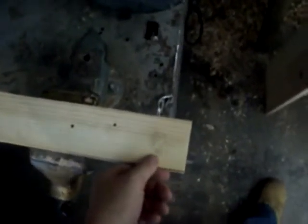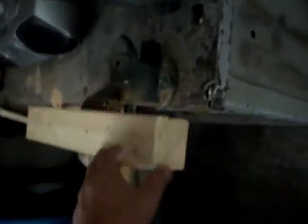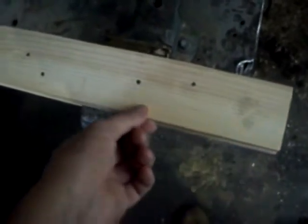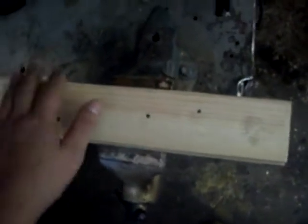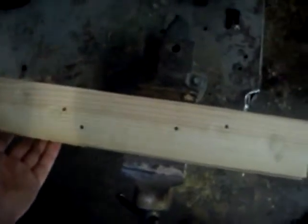The first thing I'll be doing today — this is a sample piece from the legs I'll be building for the desk. It'll be two and a half by two and a half. I'm going to try to use my router to round off the legs instead of using a hand plane and a chisel. I'm not going to do this side because I used finishing nails to hold it while the glue set. So I'm going to see how it turns out.